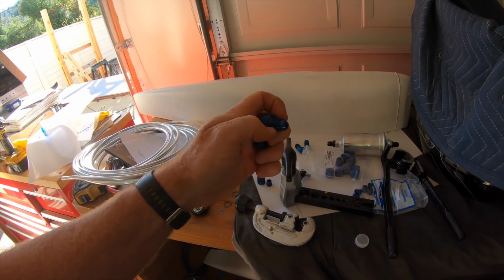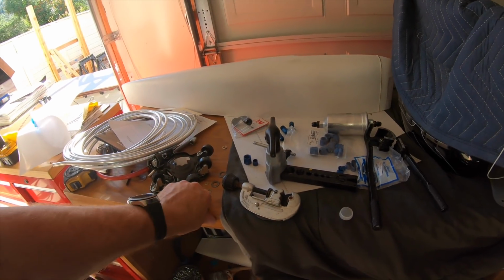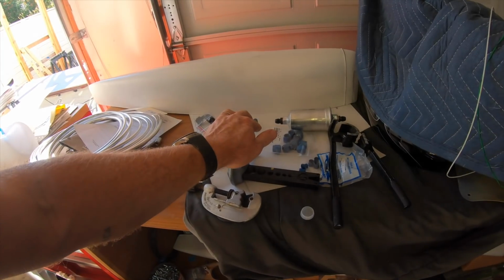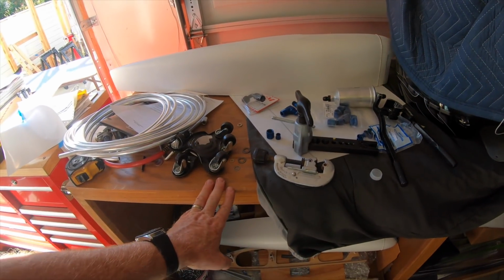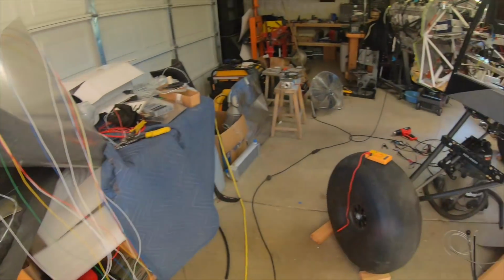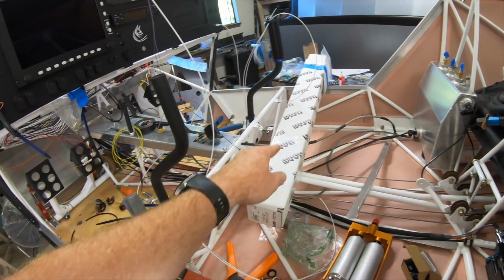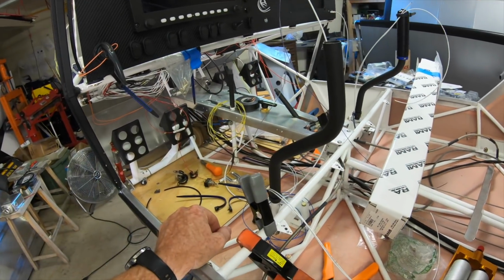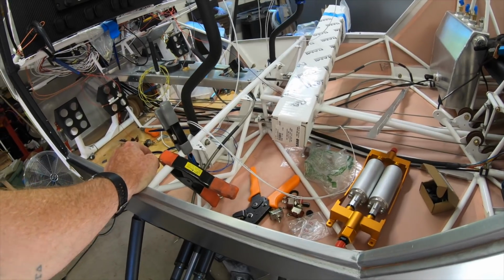So you're going to run your straight aluminum line to that. If you guys haven't done that before, it's not a big deal. It takes time. Having a proper good flare tool and a good bender so you can route it the way you need to, and just take your time routing it all and make sure there's no contact or any rubbing points. So getting it from over there and through where all this stuff is here up to the fuel valve is going to be the chore. But you know, obviously it can be done because that's how you're supposed to do it.